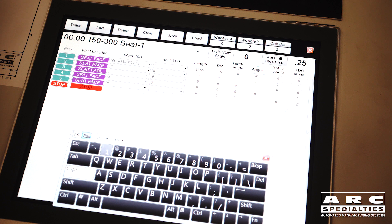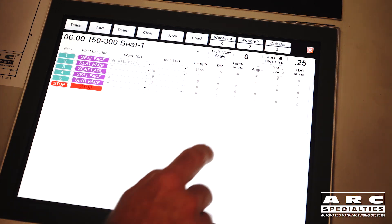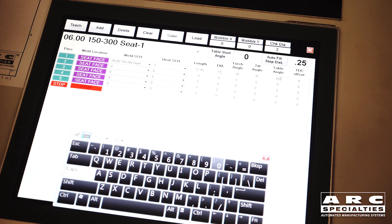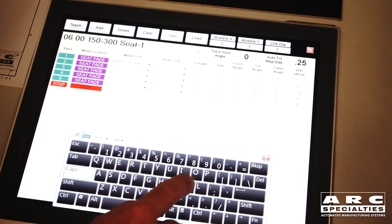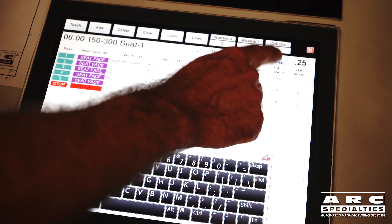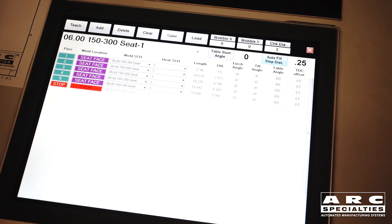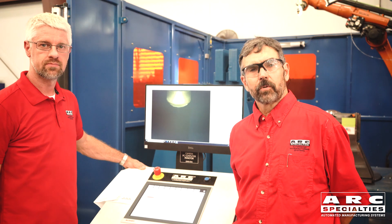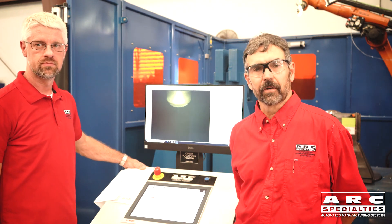If you look in the upper right-hand corner, it has a step distance. What Nick wants to do is a five-pass weld, so he'll auto-populate the field by hitting the auto-fill button at the upper right after he populates the first line. This populates the rest of the program. He's just created a multi-hundred line program to weld this part — a weld schedule, a preheat schedule, and six pieces of dimensional information — a program with five passes, probably hundreds of lines long. It was that easy.